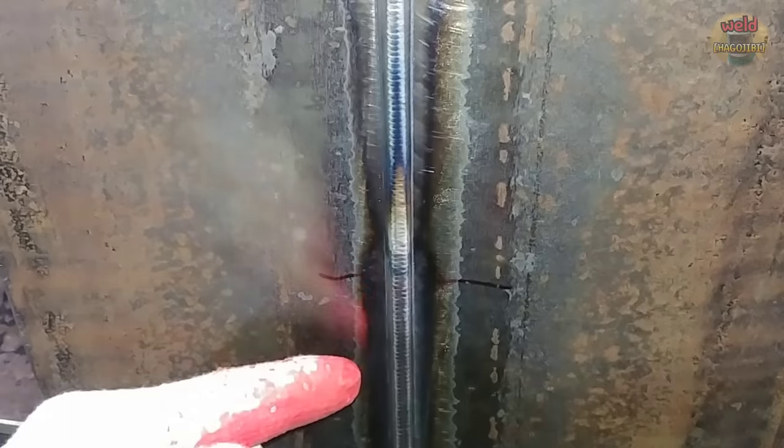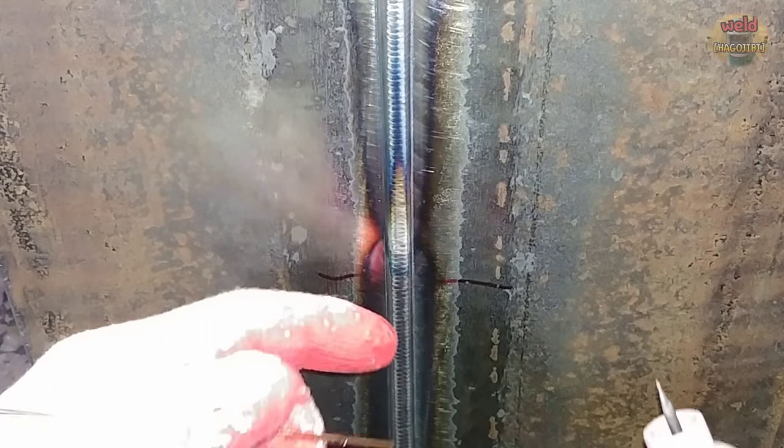In the result, when welding under the same conditions, the bigger nozzle size provides better shield gas coverage and weld quality.